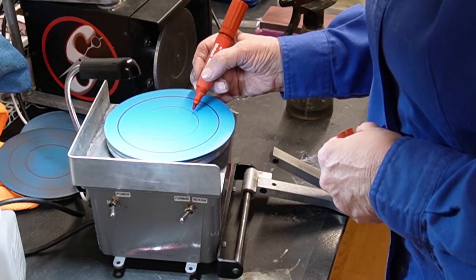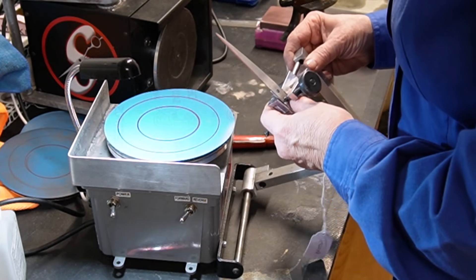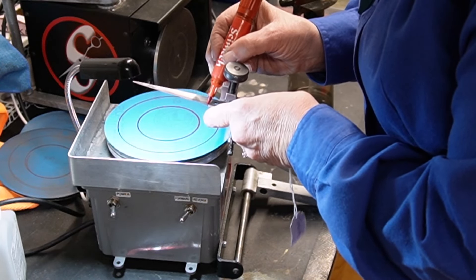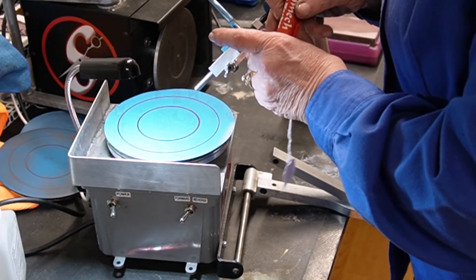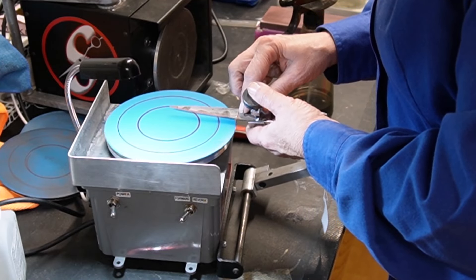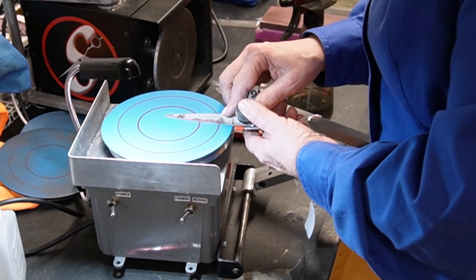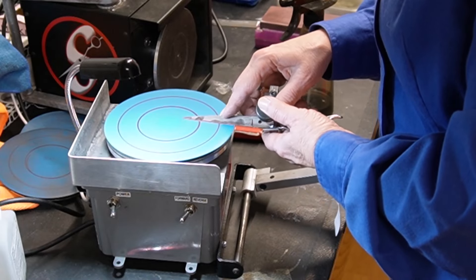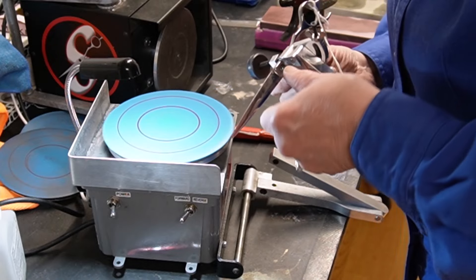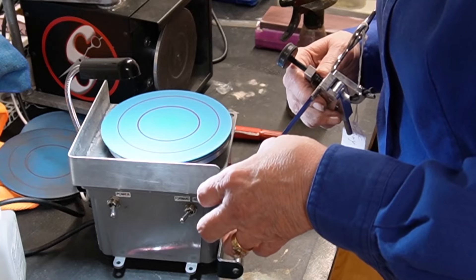Can you see the two rings? I put a line at the shoulder so I can see where I am, and I think about landing the blade between the two rings with that line at the shoulder. That keeps me from putting too much pressure at the tip, which would push it up and create a dip. I pull it out and just keep worrying about what's touching in that center area. I'm going to feel and see if I've got all the nicks out — sometimes you need a fingernail. There's a big old nick here.